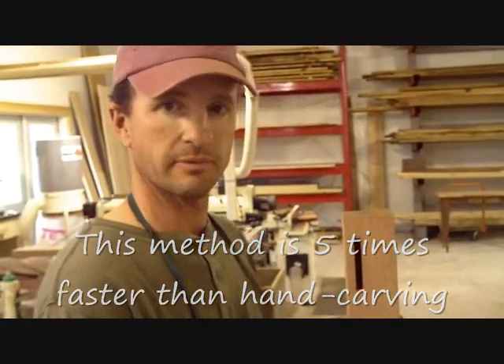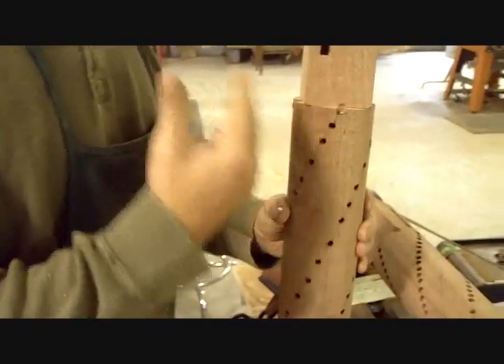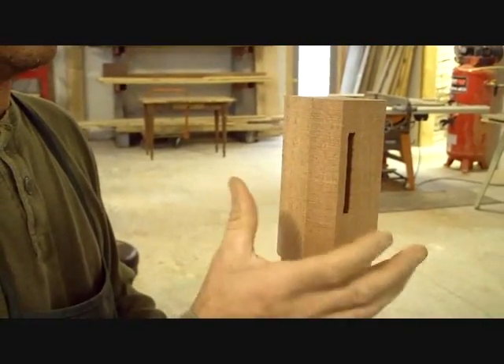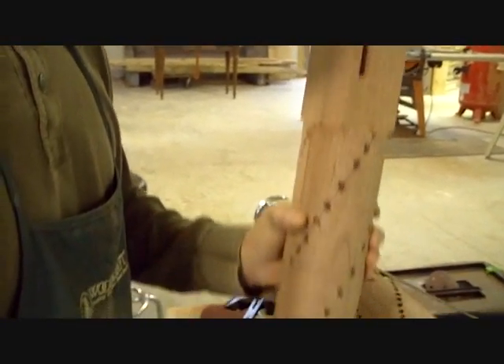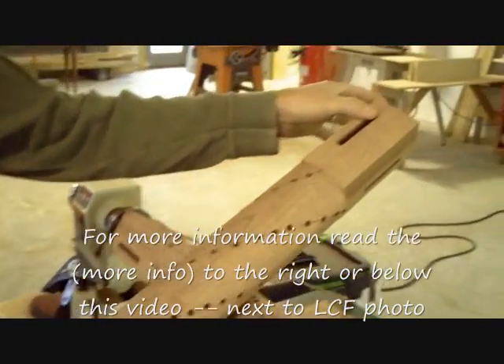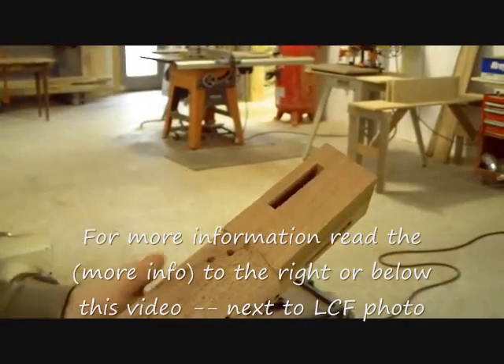Here's one of the legs before I put it in the lathe and started grinding on it. I started with 4x4 stock, just two pieces of 2-inch glued up at 1-7-8. Once I had my 4x4 stock, if you're going to do a mortise and tenon, you need to do the mortise and tenon first. You need to get that tenon in there while your stock is still square.